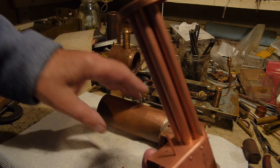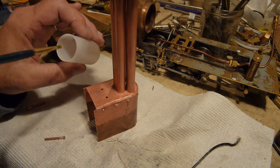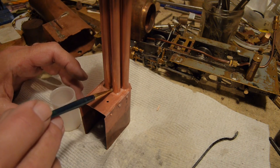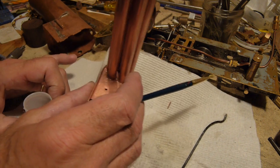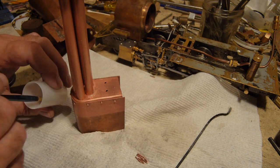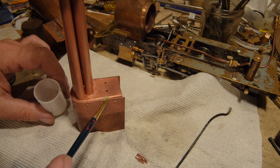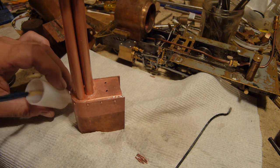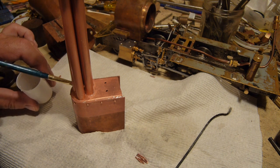What I'm doing now is pre-fluxing the joints with a mixture of flux and water. I've been told it's unprofessional — usually you just dip the silver solder into the flux as you go — but on a job that's going to take a few minutes to get right, I prefer having flux already in the joint. Using propane as a heating source, the metal goes black very quickly as the gas exhaust carbonates around it.